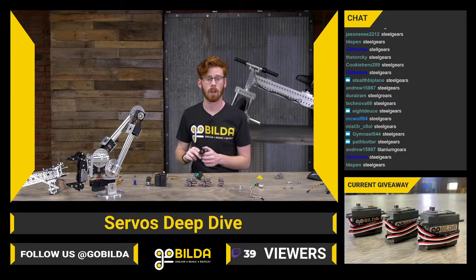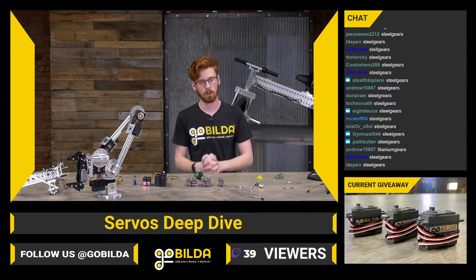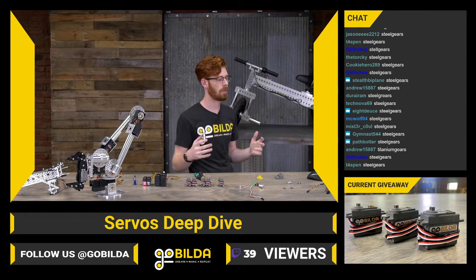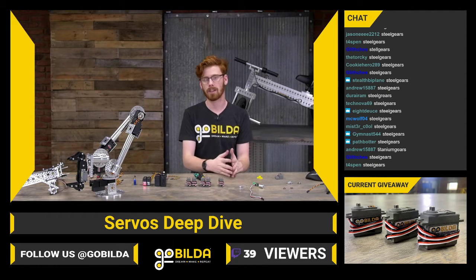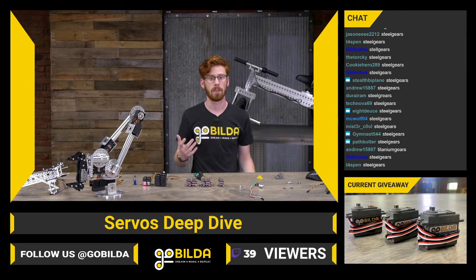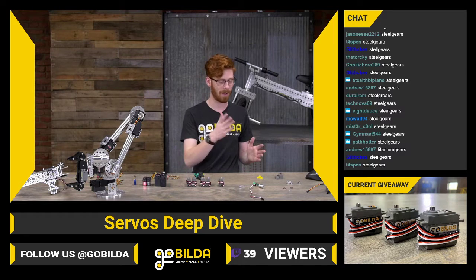It's going to have some mixed materials in there because in the early stages of a gear train, it won't see really any torque. And the advantages you get from having a really expensive, really nice gear train really taper off when you're talking about the first stages of a gearbox, where the mod of your gears might be 0.2, where they're just tiny teeth.